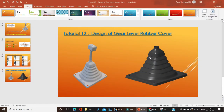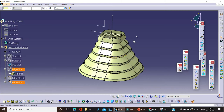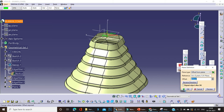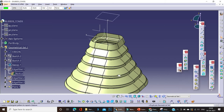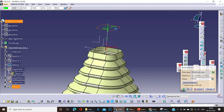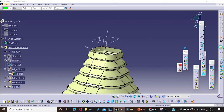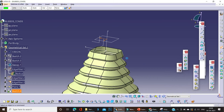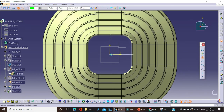The ribs are completed. Now we'll move towards the upper end — the upper closing part. Using the multi-section solid, since the bottom side has a rectangular shape and the nose is going to be closed with a circle, we'll offset a required distance plane and take a reference of that plane. We'll project that circle onto that particular plane and draw the circle with a dimension of 40 mm.